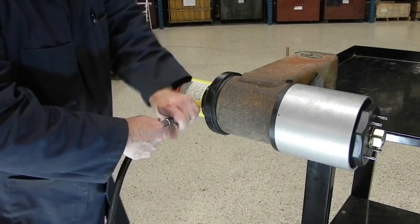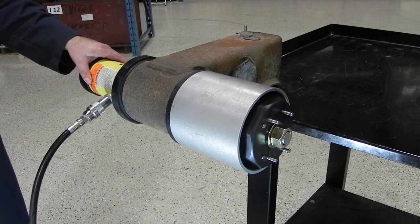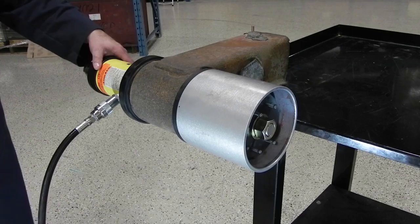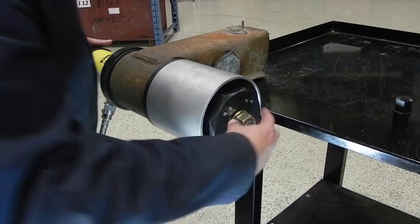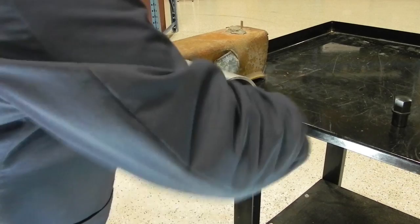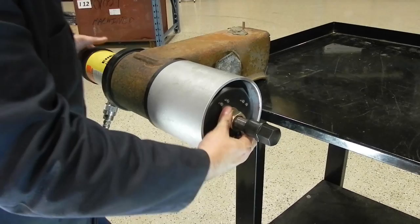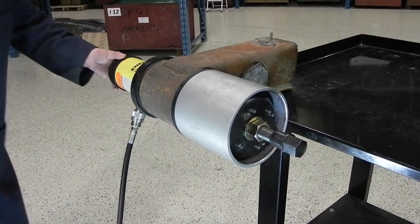Next, attach the hydraulic hose to the cylinder, tighten it up, and apply some hydraulic pressure — it should start pulling that bushing in. The cylinder will pull it in about two inches, then release the pressure. Tighten up the nut on this side; the reason we do that is just in case the bushing is tight fitting through the sleeve in the beam, we have an impact nut that can be threaded on the end to use a hammer on. Once we've tightened up this side the first time, we can tighten up the opposite side from now on. Tighten this up, then apply the hydraulic pressure again.